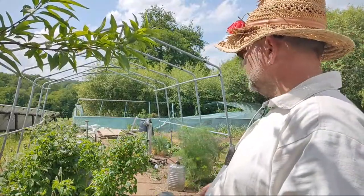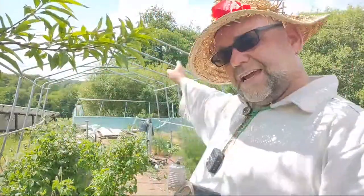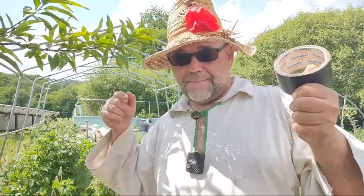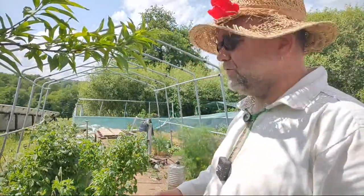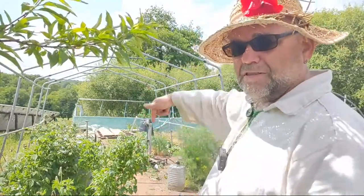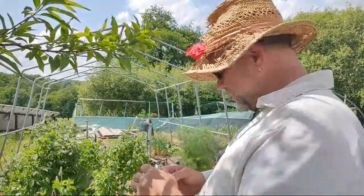Get the galvanised as well. And then we're attaching the cover to that, but I was quite fortunate that the tubes of this garage slide into those tubes. So what we'll do is raise the tubes up and then put another bolt through to fix it down, and it should pull the cover tight to the stakes in the bottom. Plus, we've got a lot more structure. For instance, on the ends, there's going to be structure to take the doors and stuff. Now, there'll be two posts, concrete or driven or whatever, into the ground to create the doorways. So that's the plan.